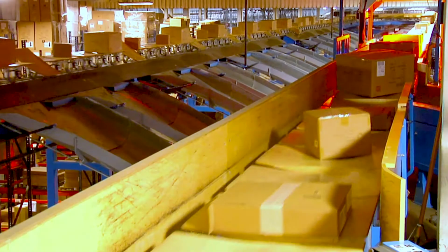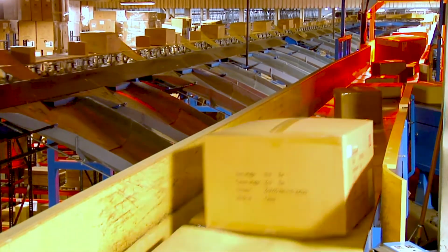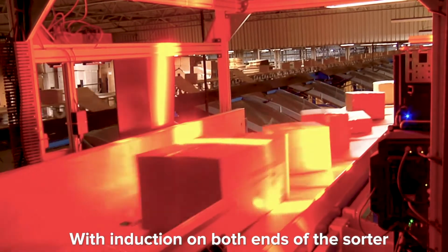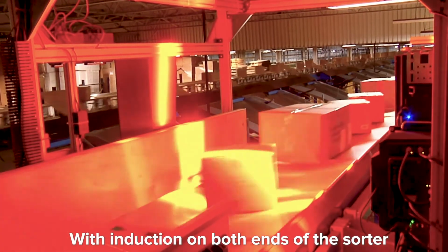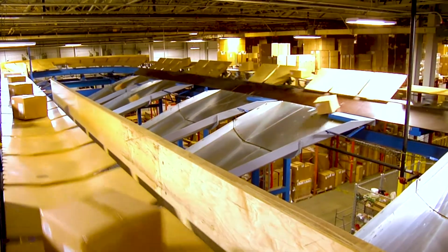Throughput is based also on the customer's needs. Just for instance, a large tilt tray at 625 millimeter pitch, that would yield about 23,040 trays per hour. And then the smaller unit would handle 22,000 trays per hour. It's really ideal for e-com. We've used it a lot for direct-to-consumer shipments, sorting polybags, envelopes, to gaylords and mail bags, mail sacks.